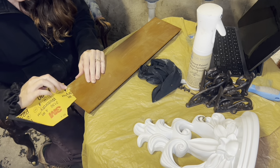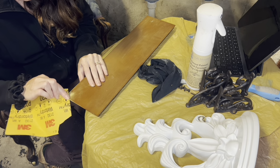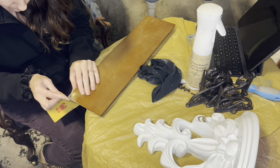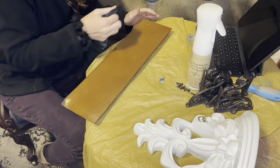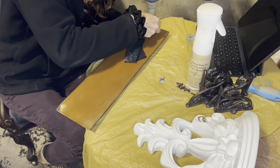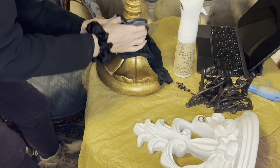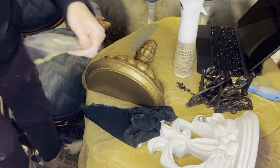The reason I did the glue on this is because now if any moisture does touch it — because it no longer had the coating on it, that weird plasticky faux wood finish coating — it's susceptible to liquid. So with the glue on there, it kind of strengthens it and makes it so that if any moisture comes near it, it's as safe as it was with the coating. Actually, it's probably safer. So I'm just going to go through and clean up all these pieces and sand the ones that really need a little extra help.